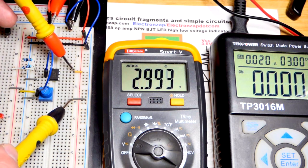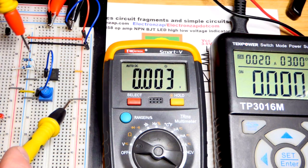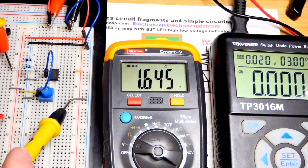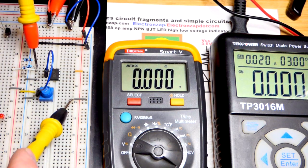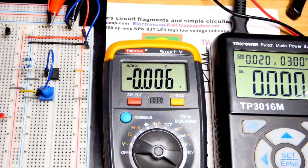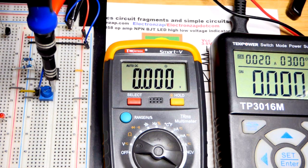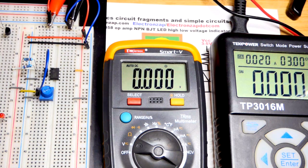I really love this portable power supply — not perfect but it does what I need. The output voltage is high right now, and that's as much voltage as we can get — it's about a volt and a half below the power supply voltage, even without a load. It just cannot output the full power supply voltage. We can turn the trim pot down past halfway and the output goes to the negative rail.